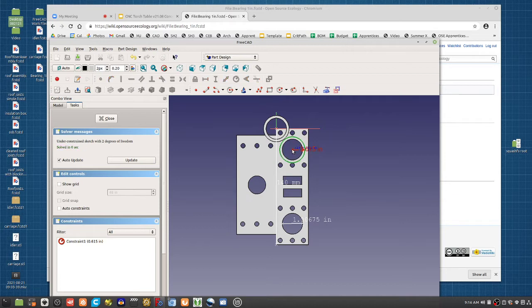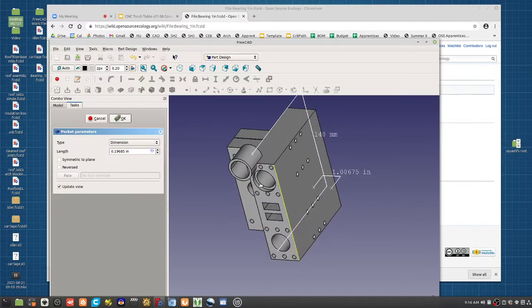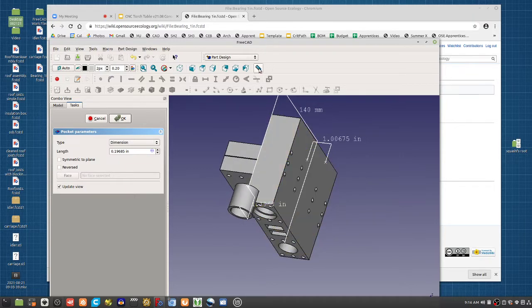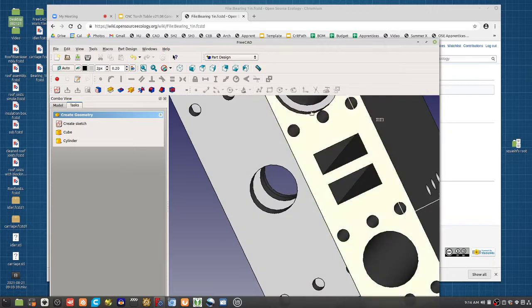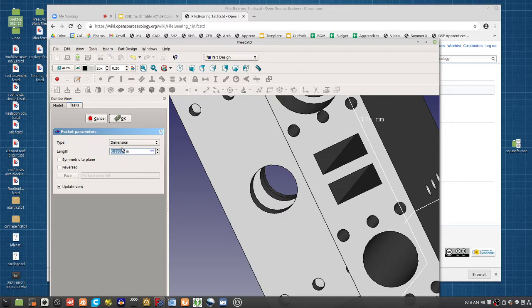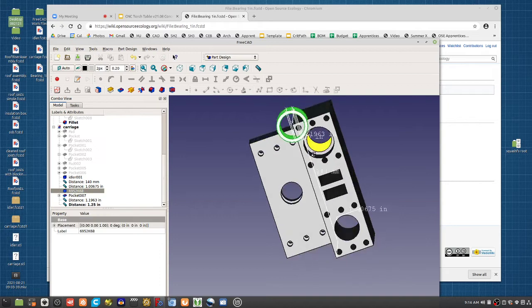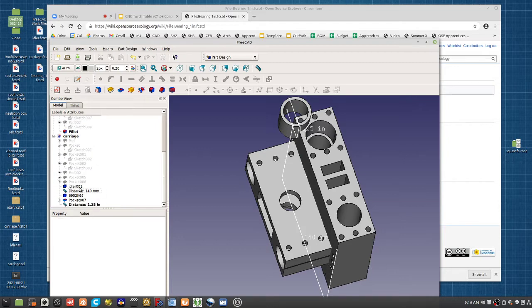But if you do this, then you have a bearing hole, so we could pocket that, for example, to the length of the bearing. What's the bearing length? 1.25, is it? Yeah, it's about 1.25. So, in other words, this pocket here that we just pocketed out last, you want to do that 1.25. So there we go, we've got a bearing hole. If you put the bearing in there, what happens? You need to keep it there. How do you keep it there?